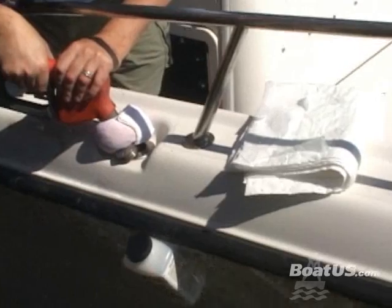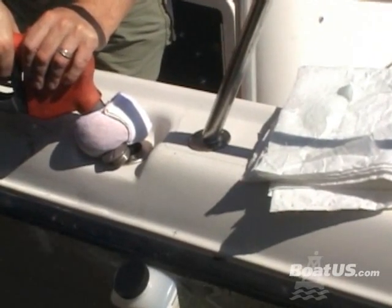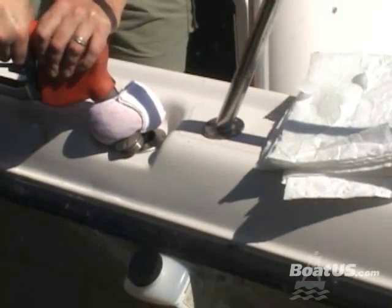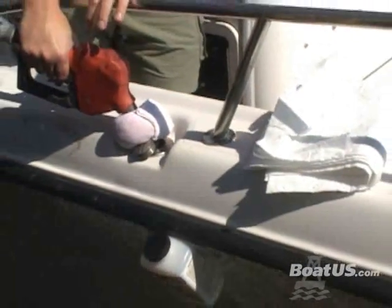While refueling, listen carefully for any change in tone as the tank fills. With practice, this sound can let you know when the tank is nearly full. Never top off a boat's fuel tank.